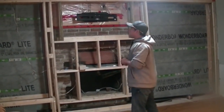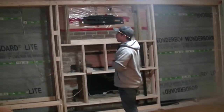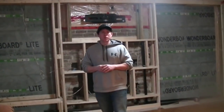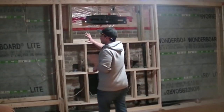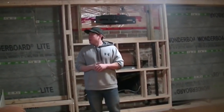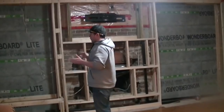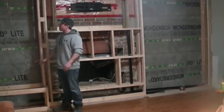As you can see, I have most of the rough-in ready. I decided to go with Wonderboard as a backer. I'm treating this as a true wet zone, almost as if it's a bathroom installation. When the living wall system is installed here, I want to know that everything behind it is essentially waterproofed. We'll talk about the waterproofing in a coming segment, but everything's roughed in. I've created a basin here for where it will all drain down.